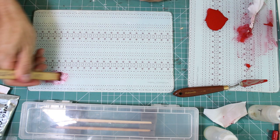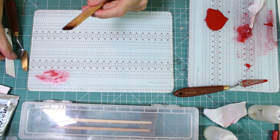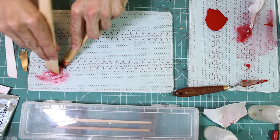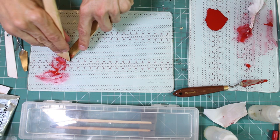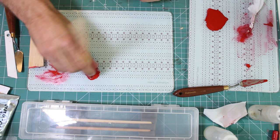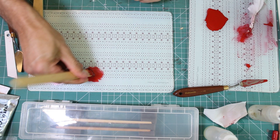You have to infuse the hair with Urushi. Work it as shown in the video, then push the rest of Urushi from the bristles with a wooden or plastic spatula — scrape it and push it out. You have to repeat this process several times; I usually do this three times with a hake that was stored in oil. Sometimes after sharpening the hake I wash it with shampoo, then dry it, and after such a procedure it does not require such thorough cleaning.